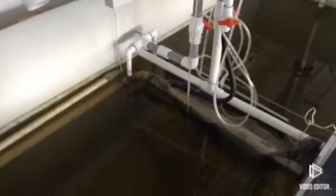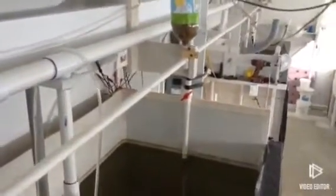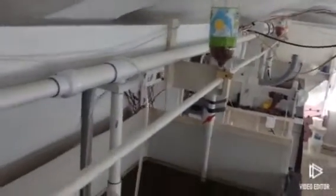I can divide the 500-gallon tank into 250s, and then I'll have a feeder for over here and a feeder for the other side. The little synchronous motor at the end is a 3 RPM motor, so you just set it for whatever amount of time it takes to put the amount of food you want in.